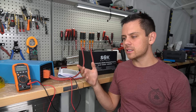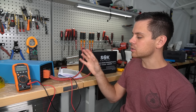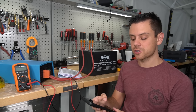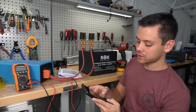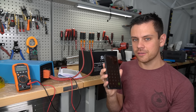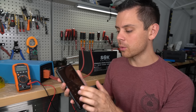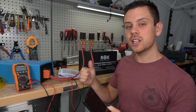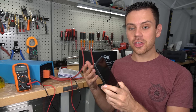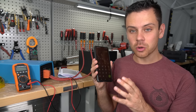We're going to power a Starlink and some LED lights in normal on mode — not eco mode — because we want the loads to run 24/7. So 10 watt-hours times 24 equals 240 watt-hours for a full day, and for a full month that's 7,200 watt-hours. For the cost of running my big system for two days, I can run this model for 30 days — that is a massive difference, running 24/7.